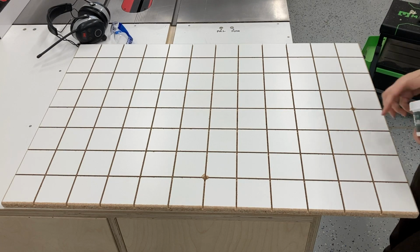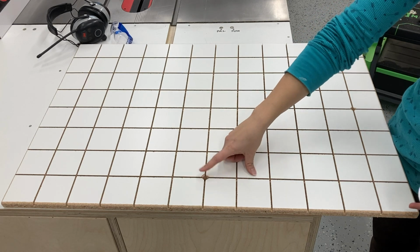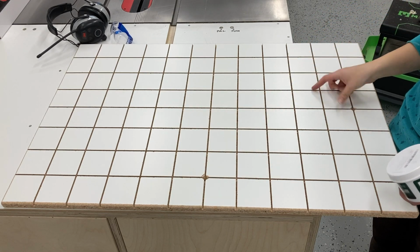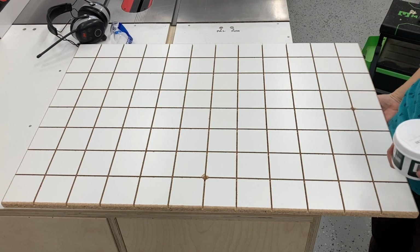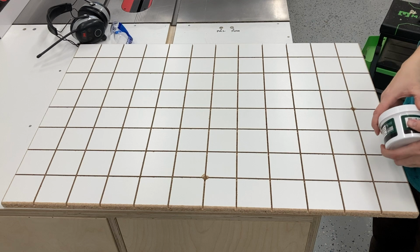I have drilled a 3/8 hole centered on the edge of the long side and the short side of my platen. So that way I could plug the vacuum hose with this platen oriented in either direction inside the bag.